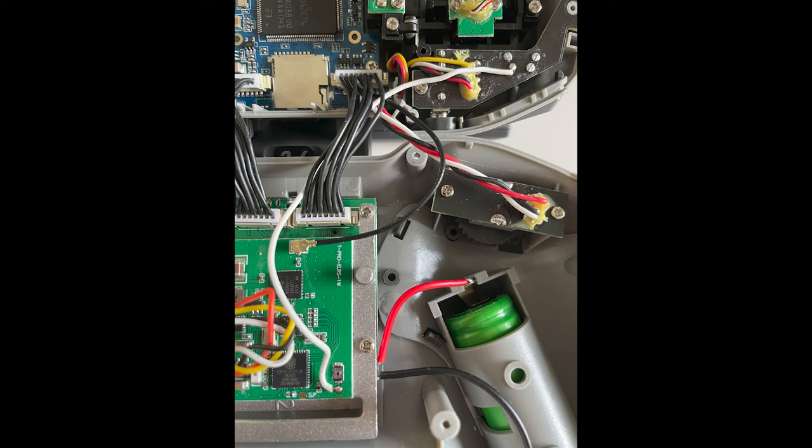This little tactile boot switch puts the ExpressLRS internal module into boot mode so you can write firmware to it — this is the part that Jumper forgot to coordinate with EdgeTX and ExpressLRS on. I recommend making a modification here: there is a small pad underneath the boot button — solder a wire from that pad up to your right trigger switch. This brings the pad low whenever you need to flash the internal module through EdgeTX pass-through. This change will actually be implemented in future production runs of the Jumper T Pro, so you don't have to tear the radio apart. I highly recommend soldering this wire in.